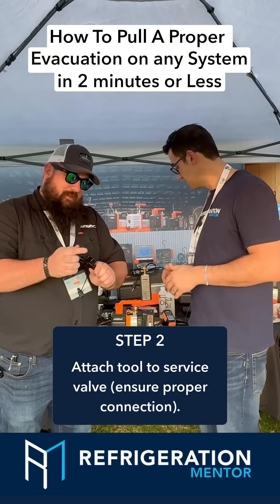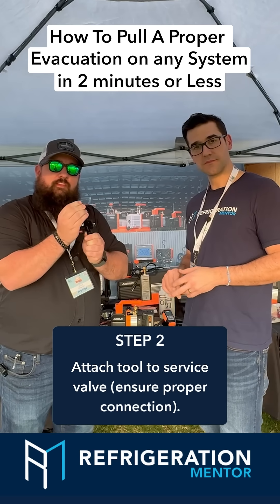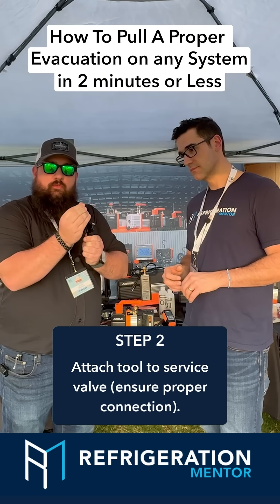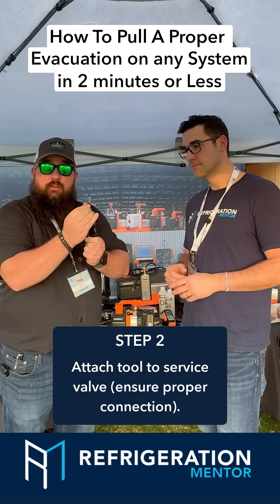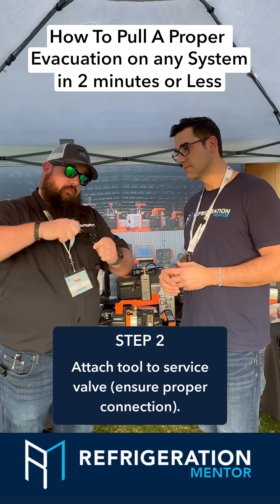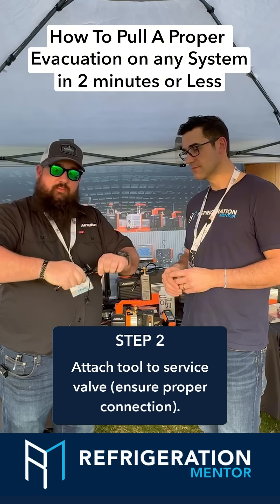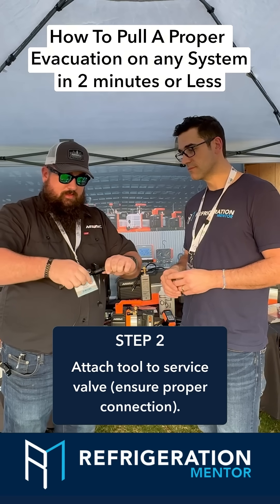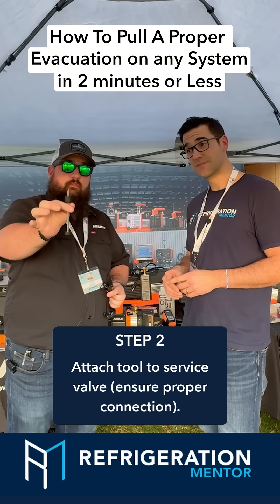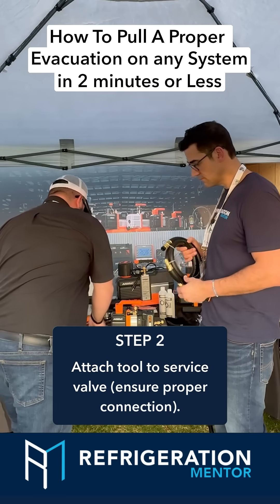Because that will pop back. So once you twist, you'll notice a noticeable click that signals that you've actually grabbed your valve core tool. You'll twist until you feel another click — once you feel that, you know you've actually grabbed your valve core. Now pull the plunger and shut this. There's our valve core tool. We shut this to make sure we don't get ourselves hurt if this was a pressurized system.